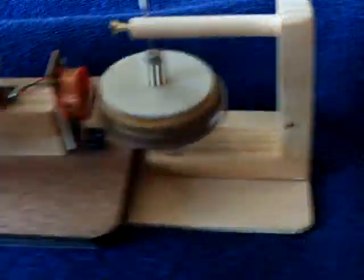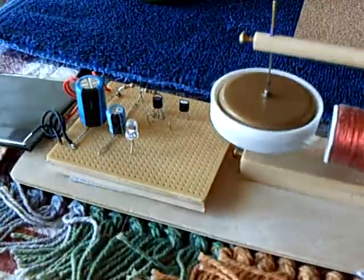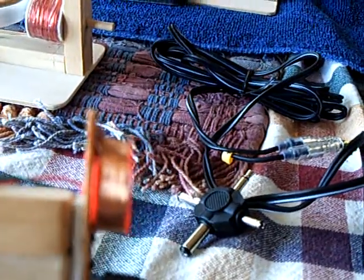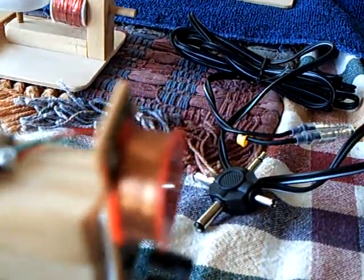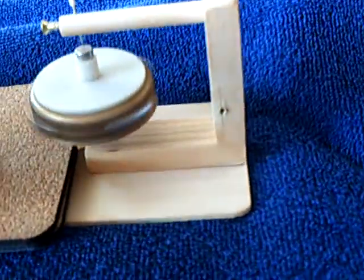This little thing here was the most efficient driver unit that I've seen — that thing right there. And this is a close replication of it, but it's not the same thing. That coil has many thousands of windings and very fine wire, and it uses capacitors to drive that rotor around.